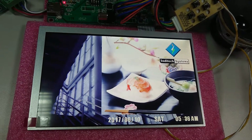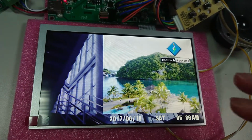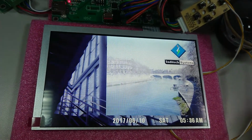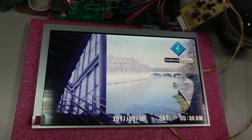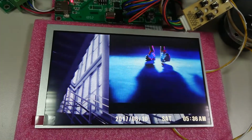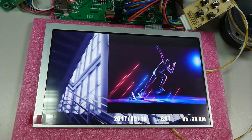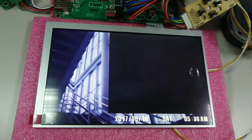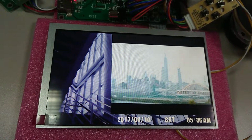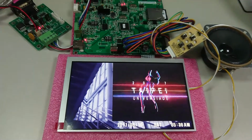After we jump back, for the elevator display, it doesn't need to be powered again, but we have to send the communication code, the signal code, to the display again, because it's turned back to the standby mode, and it will wipe the information of the lift signal. Okay, that's the basic testing of this new board.